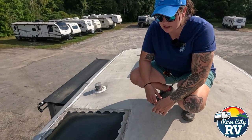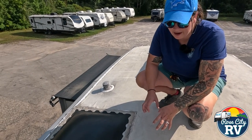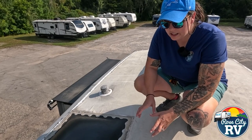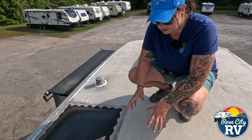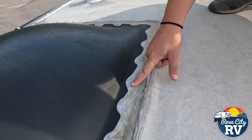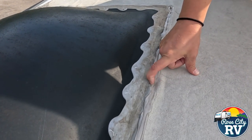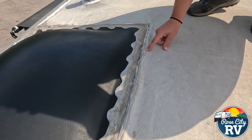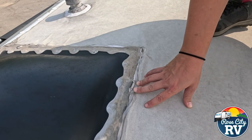You can clearly tell where somebody put silicone sealer on this roof. This is not what this is made for — you have to use the right materials or you're wasting your time. Now looking at this, you can't tell what I'm talking about; this all looks like the other. So this is the silicone, and this is the regular sealer. As you see when I push on this, it doesn't mate with the other sealer or with the rubber, so water can clearly get inside of there. As I go around here, it's not actually sticking even though it looks like it is.